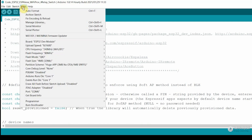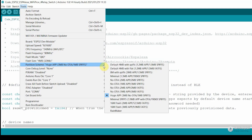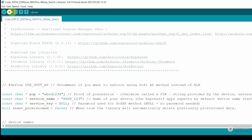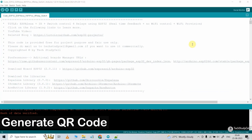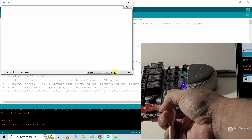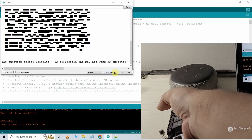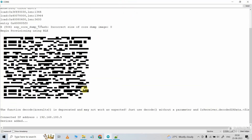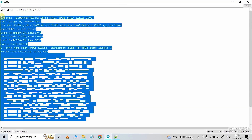After doing that, go to Tools, select the board ESP32 Dev Module, and in the Partition Scheme you have to select Huge App 3MB. Then select the proper port and hit the Upload button. After uploading the code, I will open the Serial Monitor and select baud rate 115200. Then I will press the reset button of the microcontroller. Here we will get the QR code, but I cannot scan it from here, so I will copy the QR code and paste it in Notepad++.